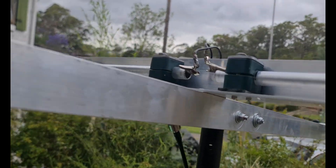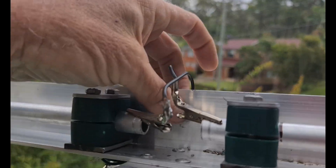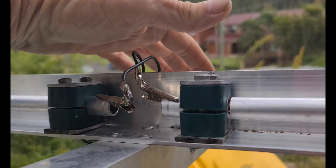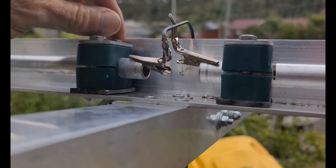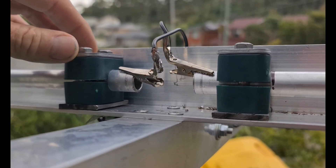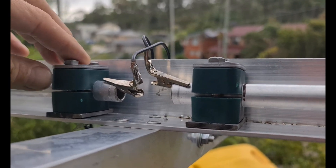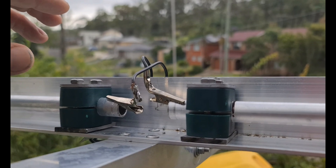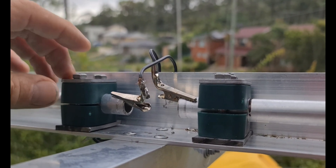We're going to make this better — drill a hole through the plate and wind on a balun. If you're going to use it outside I think it's about 5 to 5.5:1 on 20 meters, so with a decent tuner you could actually tune it in on 20 as well. We're looking at doing a half-wave tri-bander covering 20, 15, and 10 meters.